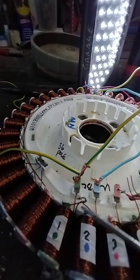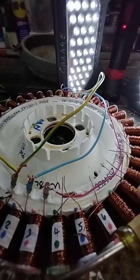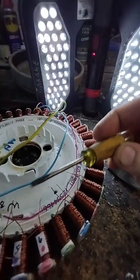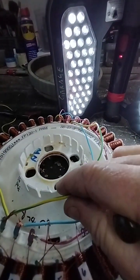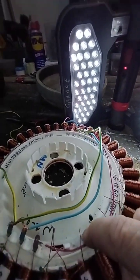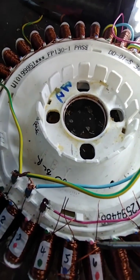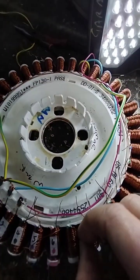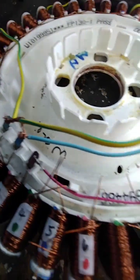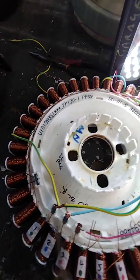The left hand wire, left hand wire, and left hand wire are all twisted together and we will solder that, then put some insulation over it — we'll get to that. This is the first stage: do the first three, then the next three, then the next three, and this will all end up hot glue gunned neatly into position. There'll be three wires running neatly around the outside rim — red, green, and blue — and we'll join our corresponding right hand wire from each color into the corresponding output wire.